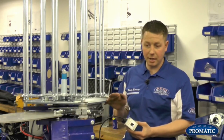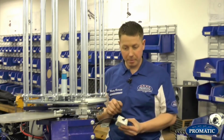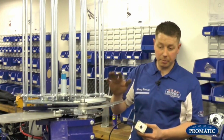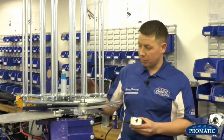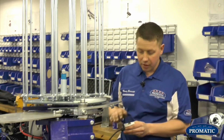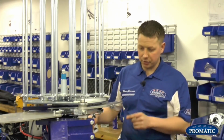Okay, this means the machine is now cocked, which is in a dangerous position. So we'll always operate from the back of the machine. If we take it up to off, disarm, you see the trap is fired, but the trap hasn't recocked. When we were talking about the clock face before, when we were setting the rear pusher timing, we are now in the 12 o'clock position. Now to make this machine perfectly safe, we will nudge it round, so it comes to an 11 o'clock position.